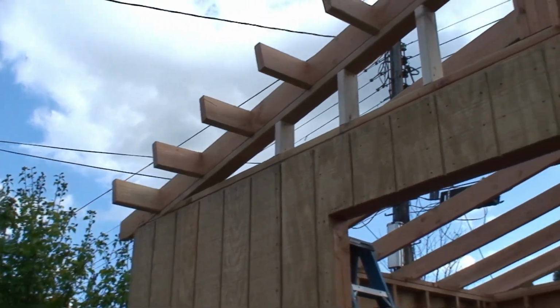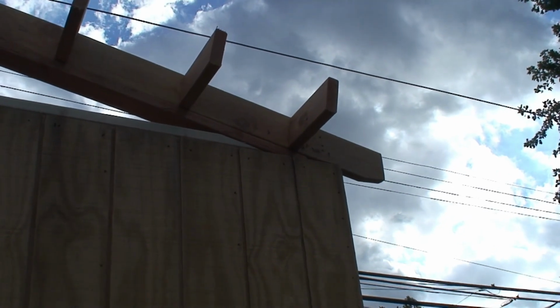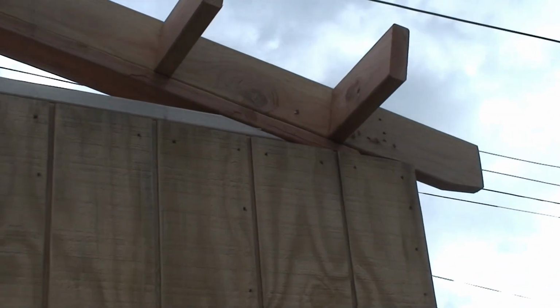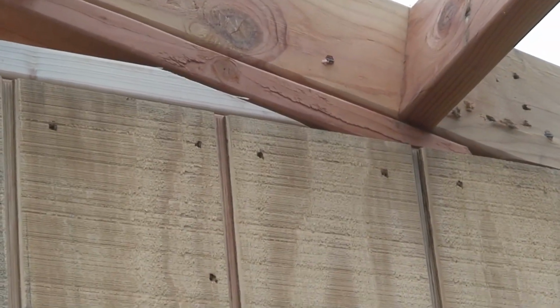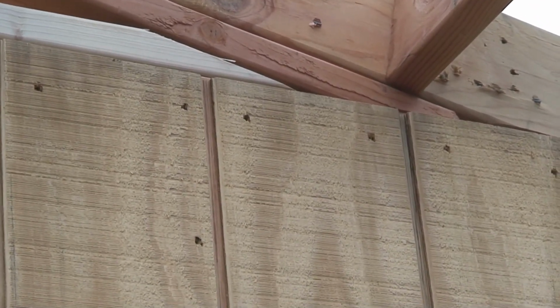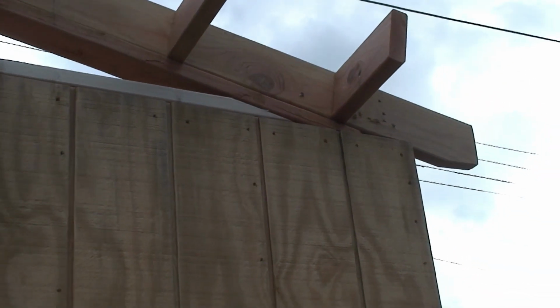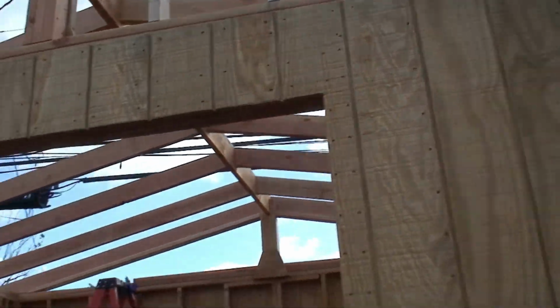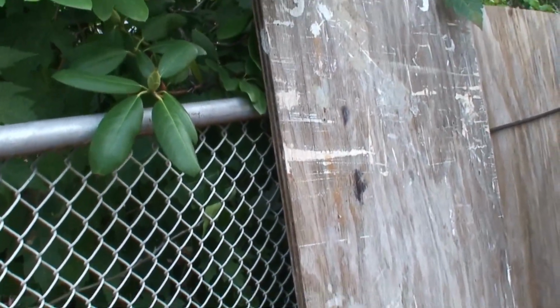What I'll do with the sheeting, I'll even put some structural glue, because that's going to be a thin cut. You're going to have a little sort of a, well, just the way you see it. It'll thin out, and I want to make sure that it's held properly, and then of course I'll put sealer on it, on the ends, because plywood over time does delaminate, even exterior plywood. Like I got stuff that's been sitting out in the rain. I must have this particular plywood 15 years.